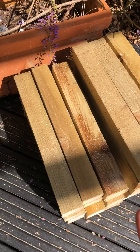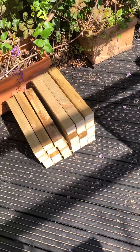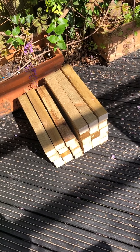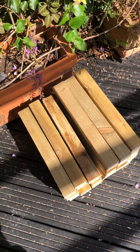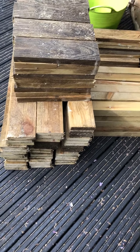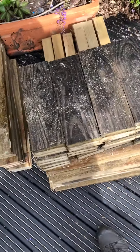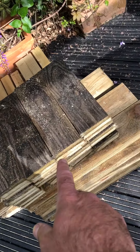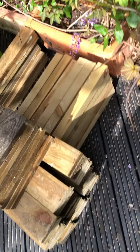There are my legs all nicely cut - 40 centimeters long, 47 millimeters square. I've used pressure treated timber but you could use a pallet or anything like that really. A bit like Blue Peter - here's some that were cut before. So we've got short ones for the ends, 60 centimeter ones for the sides, and then the leg bits.